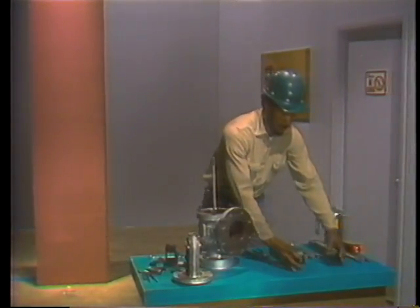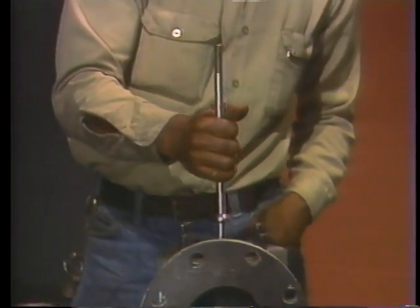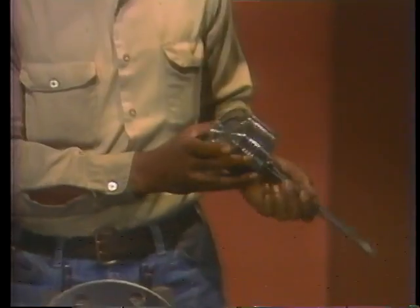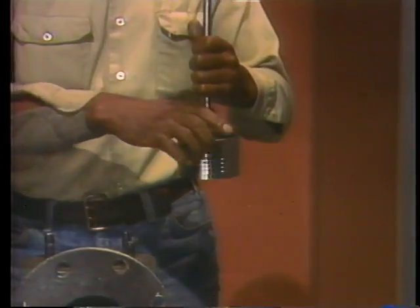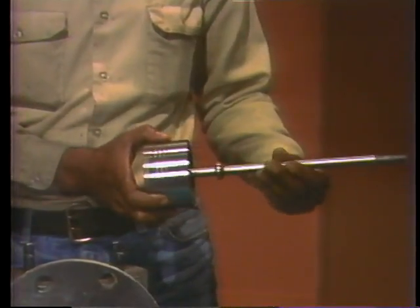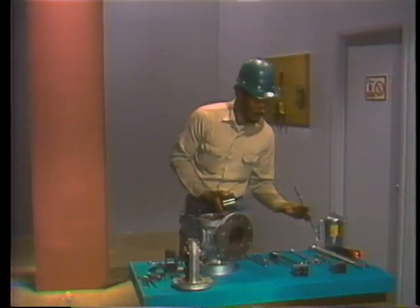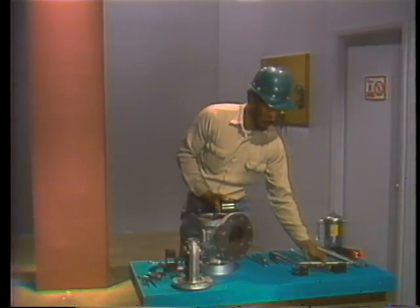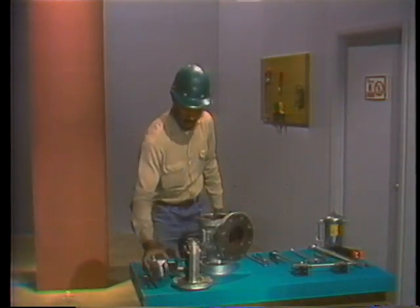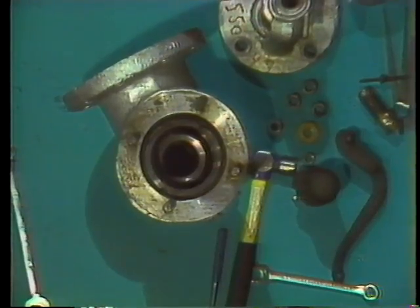At this point it's a good idea to set up a pair of V-blocks so you have a safe place to put the spindle when you remove it. Remove the spindle and the feather by lifting straight up to avoid banging the feather against the sides of the casing — a feather that's even slightly damaged will not function properly. Separate the spindle and the feather, then set the spindle on the V-blocks and place the feather on the table seating surface up so it's not damaged by contact with the table.